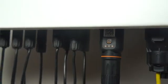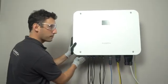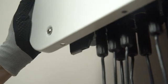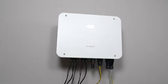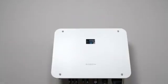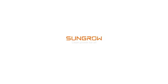Now it's time to turn on the power. First, you have to switch on the AC circuit breaker. Next, set the DC switch on the left side of the inverter to the ON position to connect the inverter to the PV generator. Now the LED display will turn on. You can touch the LED indicator to see all information. To receive comprehensive commissioning instructions, check out our commissioning videos. We'll see you next time. Thank you very much.